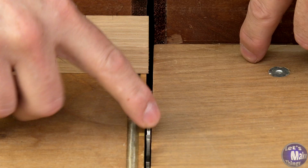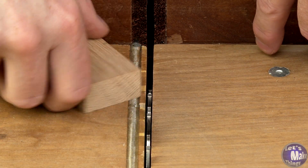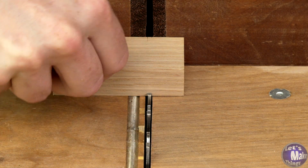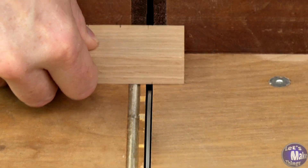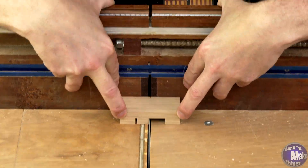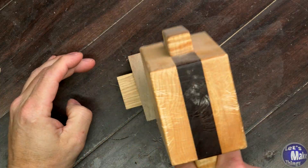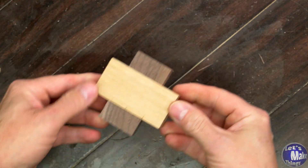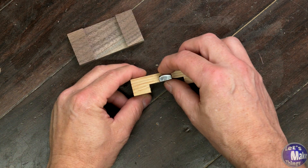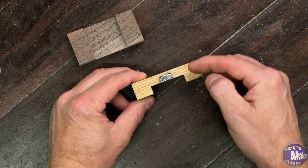At the table saw, all we have to do is line up the tooth to the mark we made and make the cut. The blade needs to be exactly half the thickness of your stock. Now with these cut, you can see why it's important to make sure that our nut is about a third the thickness of our stock.